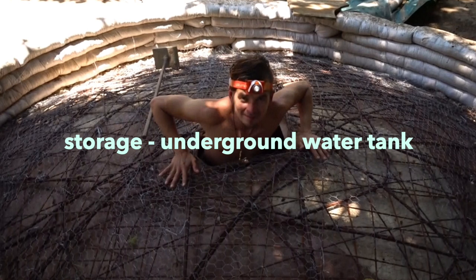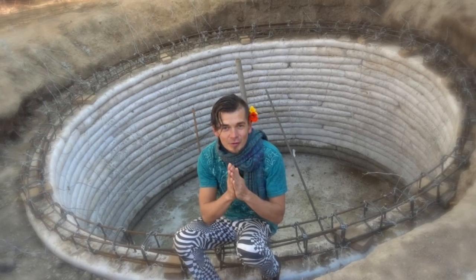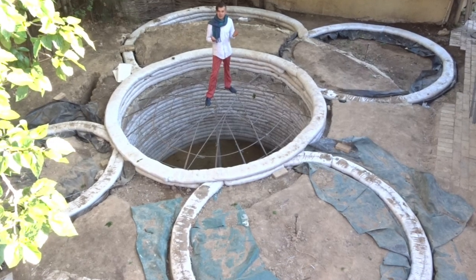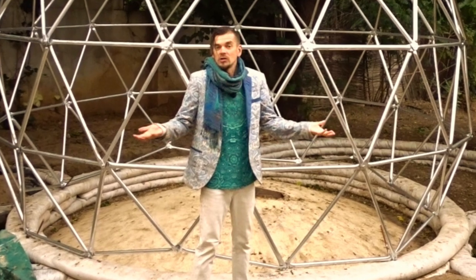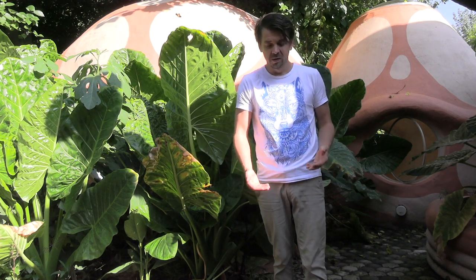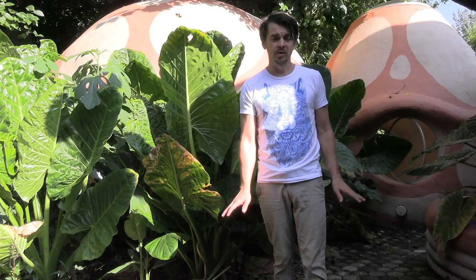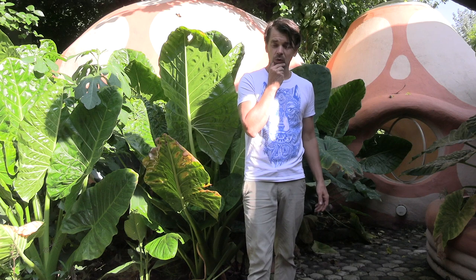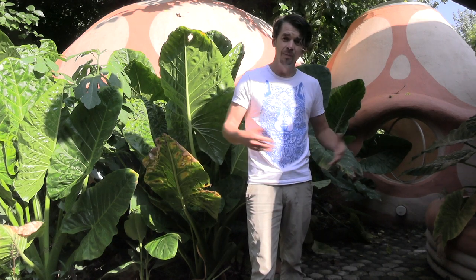Below this dome is an underground water tank. I haven't got to plastering it yet — I have built it. The first mistake is groundwater: you have to do a pilot hole, dig a little hole, and at the highest level during rainy season check how high the groundwater comes. Because if you're going to do this as a cellar, you're going to have moisture coming in constantly if the groundwater level is, say, five feet below the surface and you've got a ten foot deep cellar — then you're going to have constantly water coming in.